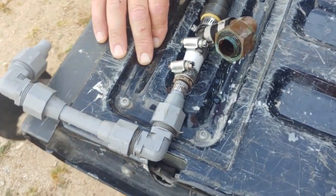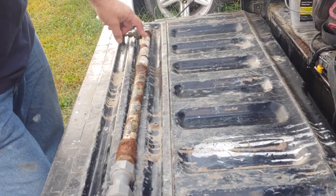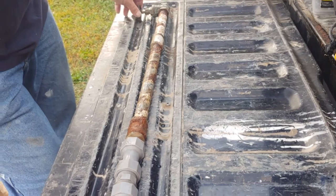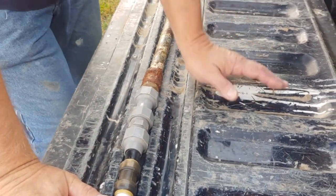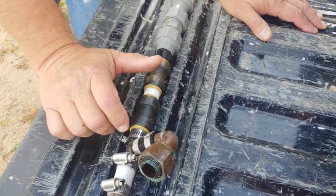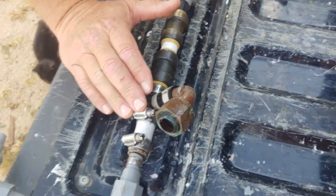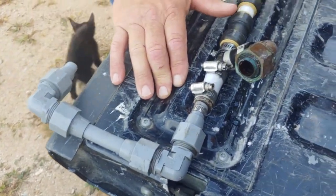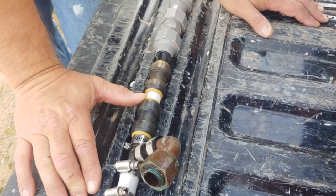What you want to do is — you wouldn't want to do the brass or the rigid. You would want to use PEX and then use a brass ball valve instead of a gate valve, which has got the big lever on it. It lasts longer, leaks less. And then you would use PEX through here and maybe gator bite here. But this is what comes from trying to patch it up. What happens is you end up with a major water bill over a period of time — you spend a lot of money on water. So I want you guys to follow me and I'll show you what we do with PEX.